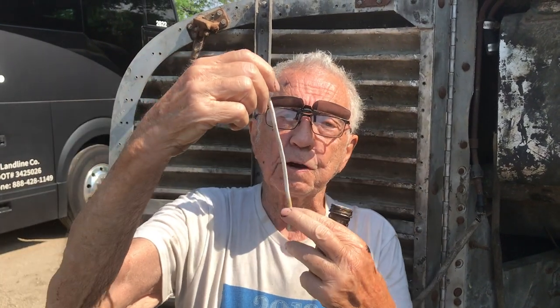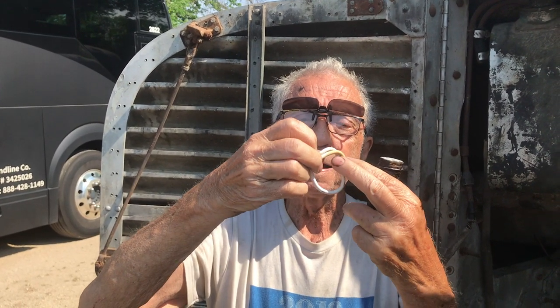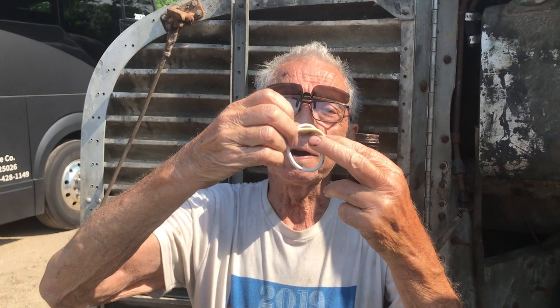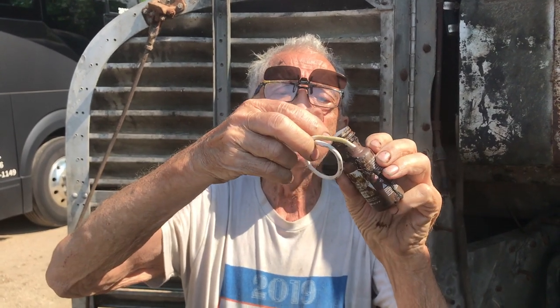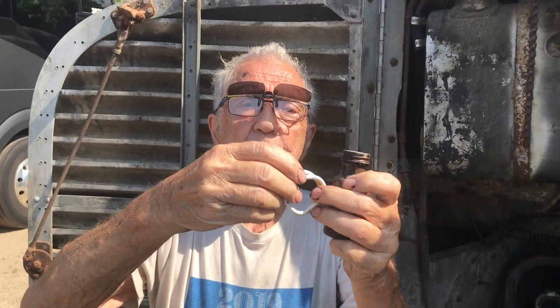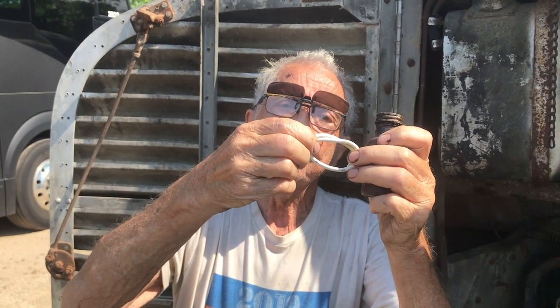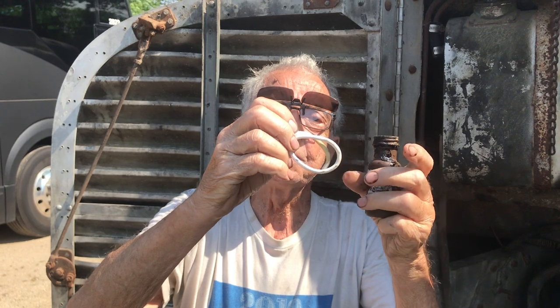So I wrapped this around the water pump pipe behind the rubber O-ring. So the black rubber O-ring goes against the engine block. This goes behind the black O-ring. Then I swoosh up the whole works with my gasket compound surrounding all of this. Then this squeezes inside the taper of that flange and bolts the whole thing together. Let it sit for 2 days, and it sets and forms an excellent seal between the water pump outlet pipe and the engine block. So that solved that problem.